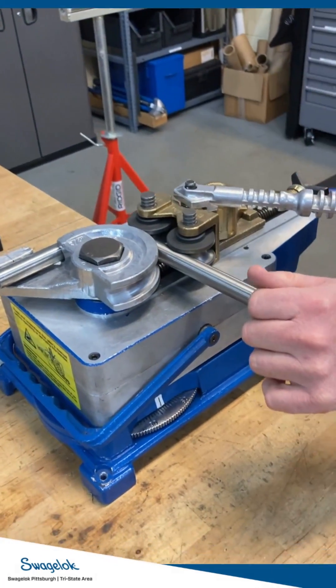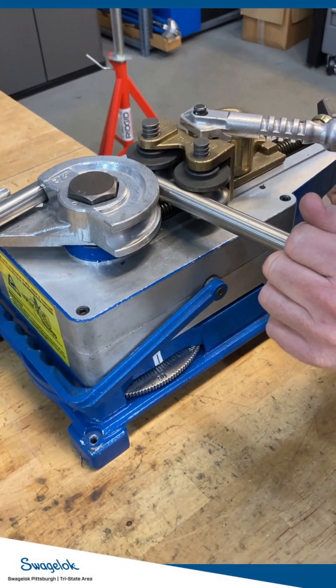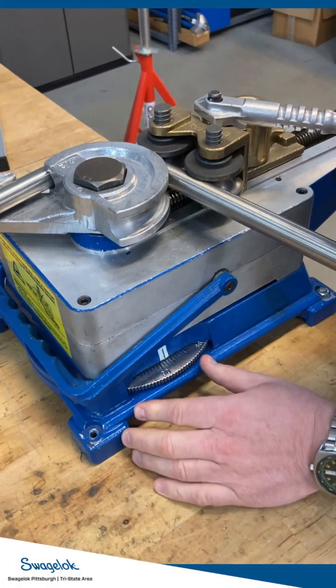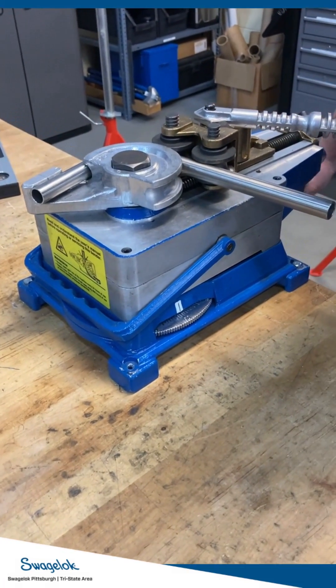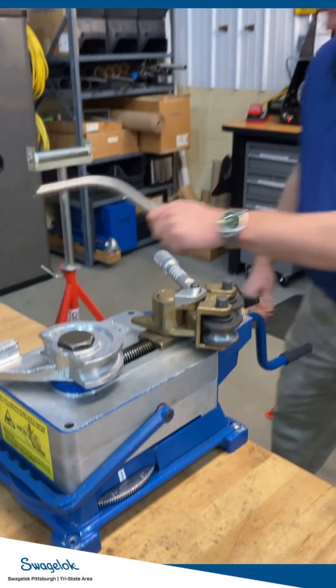I'm going to bring this back in, right back to where I stopped at 85 degrees, and come back maybe a half degree just to show where I actually measured to. At this point, I want to go ahead and bring it up to almost 90 because it's going to gain a degree when I bend it. Take it out and check it again.